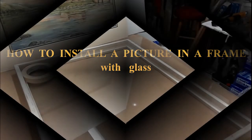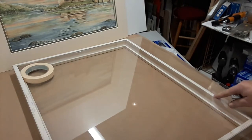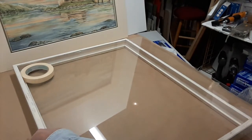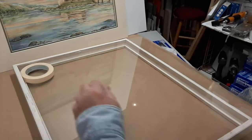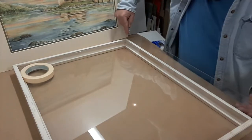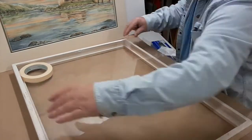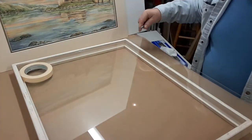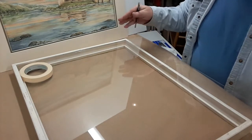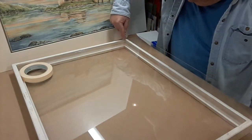Today we're doing a video on how to install a picture in a frame. I already did a video on how to cut glass, but I thought I'd show that in a deep frame when you're cutting glass directly in the frame, you need something to raise up the glass so that it's all approximately the same height. Sometimes if the frame is a little bit kittywampus you can cut the glass to a straight edge and it'll help force the frame to be more in square. This frame is real good so I'm just going to cut it right into the frame.